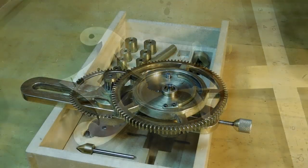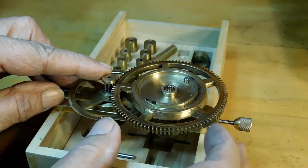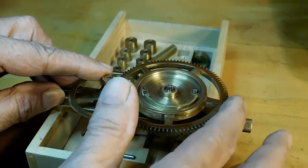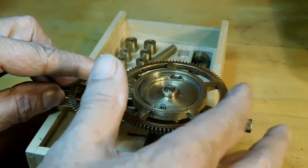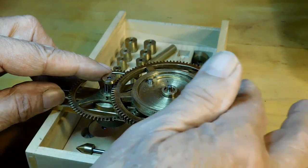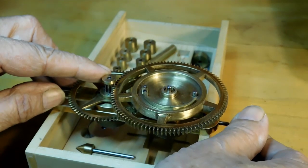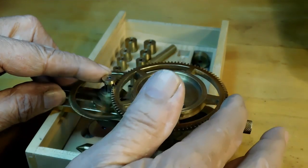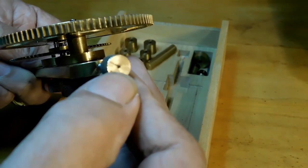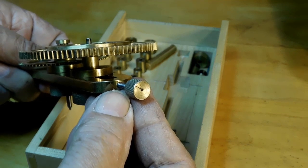This is W.R. Smith's depthing tool that we'll be using. The little one is the center wheel. I use my finger to put a little bit of tension on there and then I'm adjusting it in — I can feel it getting a little bit better with each turn. When I feel it's not getting better, I stop. I can look down at the end of the tool and see where I am. At about nine o'clock is the prime position — I'll do this a couple of times before I actually go back to the plates.